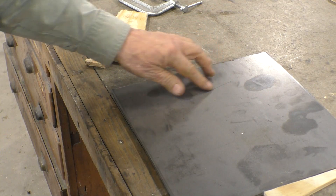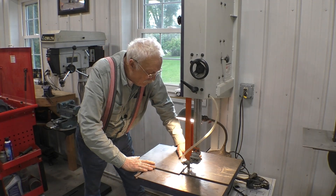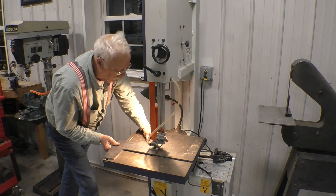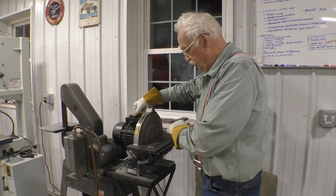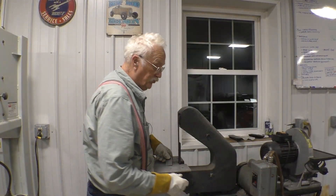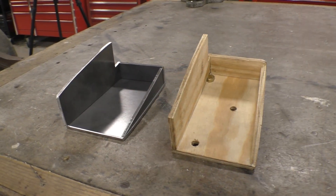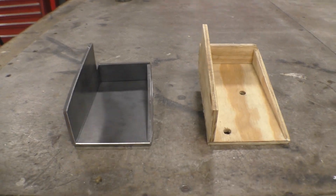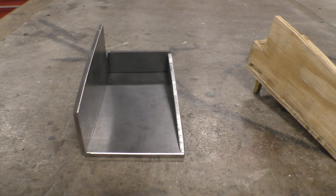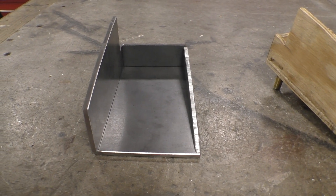We have a nice line to cut to. Here we go with our first cut, and here we are on the last cut — all done. We'll get rid of the saw marks on the edges of the pieces and round the edges so nobody gets cut. Here we have the mock-up and the steel bracket side by side. The only difference is the mock-up has a stud in it and the steel one doesn't yet. We're going to back up and reinforce the stud. Next is to sandblast and get rid of the scale so we can weld it together.